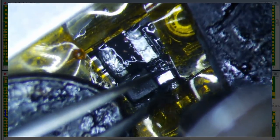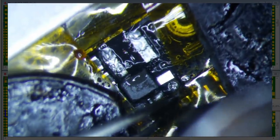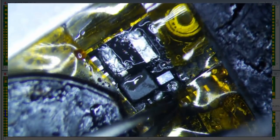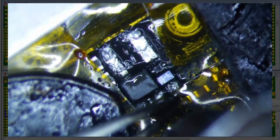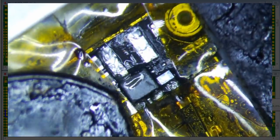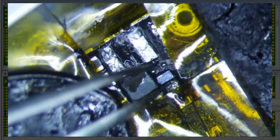And then I think this Kapton might be a little bit too much. So I'll just do this. I'm at 400 degrees Celsius with airflow of 17, if you're curious. There it goes. Not quite sure if it's quite done yet, but it should be shortly. There it goes. It's definitely good now. Alright, so that's good. You can wait for it to cool a little bit and give it a little nudge, but I know that's pretty solid.